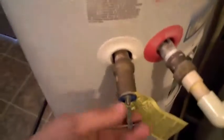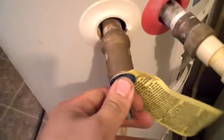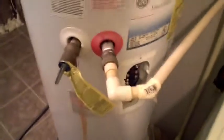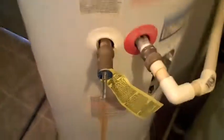But your hot water heater drains. This is the relief valve for, in case pressure builds up, there's a spring in there, and it releases the hot water so your tank doesn't explode. But if you, see now it doesn't do it, you put your lever, this is your relief lever right here, like this, lets the air get into the tank so your water can escape.